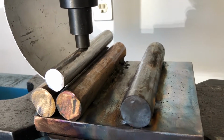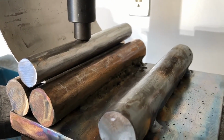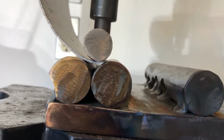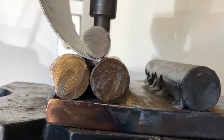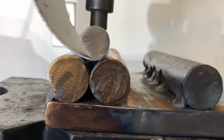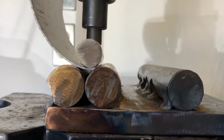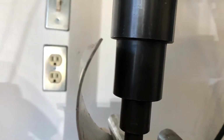So this is what I keep showing here. The rod that I'm pushing into the titanium sheet is at the very outer edge of the sheet. And one might think that when you push it in, it comes loose, but it doesn't. It grabs it tight and it puts on a bend. So I'll crank this down gradually and incrementally so that I get a curve that matches the other side. This is the curve I'm trying to match.